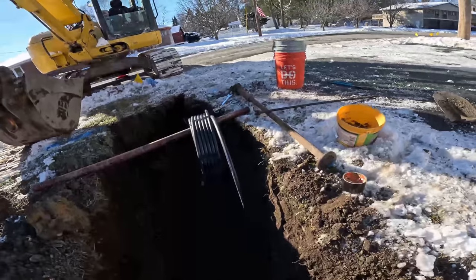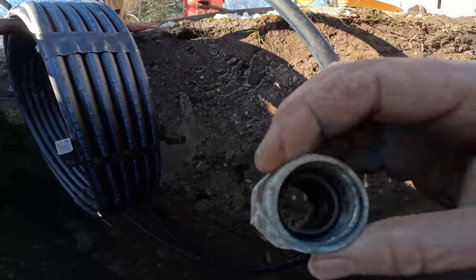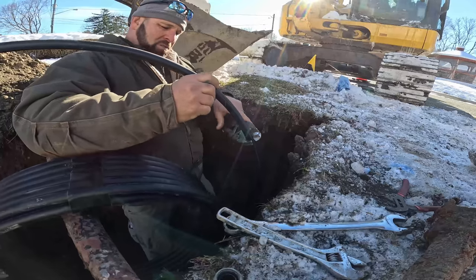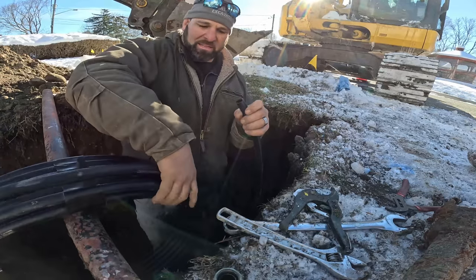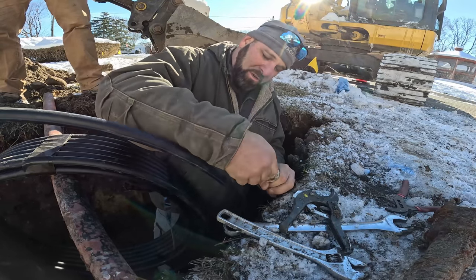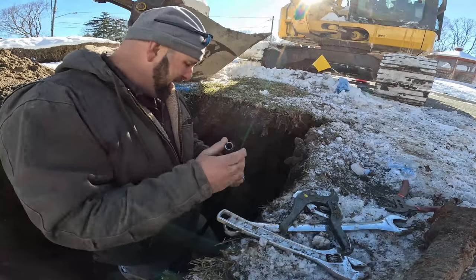About to cut this line. I'll cut it a little big and make it comfortable. Everything's cleaned up and padded all the way to this point. This doesn't have a removable gasket — the gasket's in there. There are different styles. The other style has writing on it — just make sure the writing's facing away from what you're pushing in, because sometimes the writing will cause a leak. You're going to squeeze these ever so slightly. In the summer you could flare the end of that. The biggest thing you cannot mess up is this crush fitting — you've got to put that in there. If you don't put that in there you'll kink your water line. So that gets pushed in there, then this gets stuffed into the fitting down there and then tightened up.